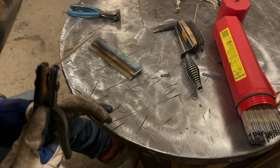Still 45 degree angle, not bad. I mean, this weld, if this was me, I would prefer to have more weld on it because ideally you want your weld thickness to be as thick as the thinnest plate you're welding. So one option we have here is to run another pass over this, which I'm going to. Another option would be to use smaller rods rather than the eighth inch and do a three pass weld versus a single, because there is a fundamental limit.